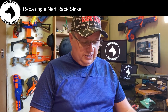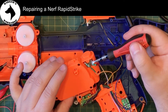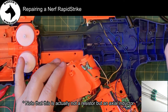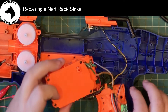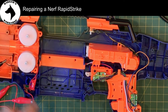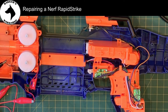I actually got the gun working but discovered some more problems along the way. Here you can see I fitted the new resistor in place — it's been soldered in and I've covered the wire with insulation tape since I didn't have heat shrink in the right size. Once I did this I found the pusher worked, and the motors work individually, but when I press the rev trigger it did not want to work.